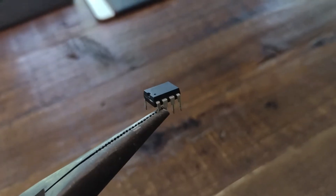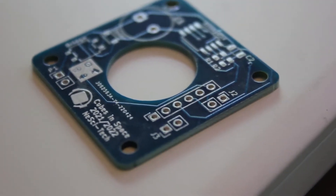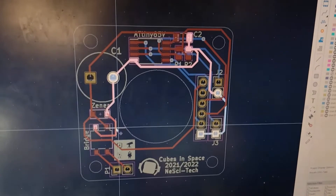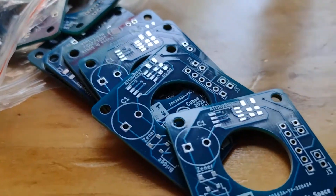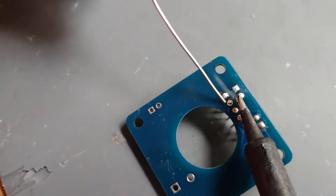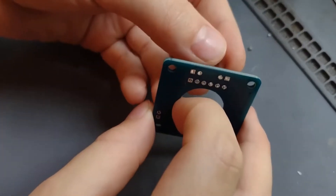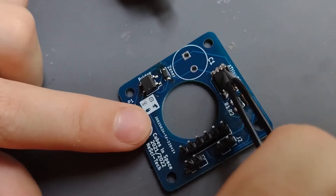This recording device consists of a microcontroller. We settled on ATtiny85s. After we finished our breadboard circuit design, we moved on to a printed circuit board. A printed circuit board is basically a permanent version of a circuit. To make the PCB itself, we used a PCB design software called KiCad. After the PCB was finished, we needed to solder the components in. Soldering is a way to easily connect components on a PCB into their pins. Some of the components were through-hole components, which means that the leads went right through it. The other ones were SMD, or surface mount devices.